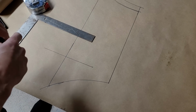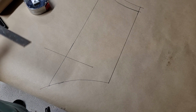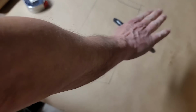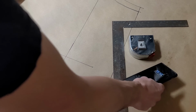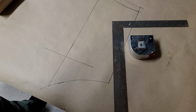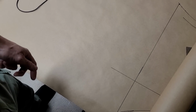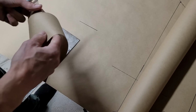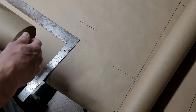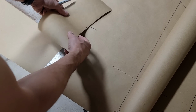So here is the vertical planform that we need for the diffuser outlet of the NACA duct. Now if we want to do the horizontal, we want to do exactly the same thing, but it is going to be 3.5 to 4.95. So let's do that over here. We'll do a line that is 3.5. And this one only has it going up. It does not go down, because it doesn't actually move that way inside the airplane.